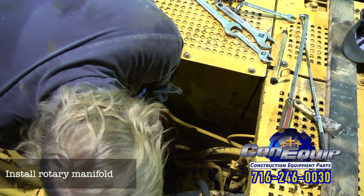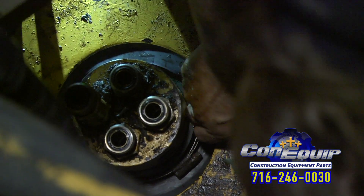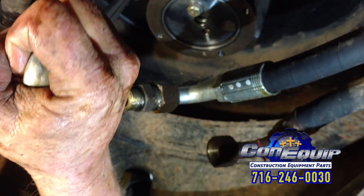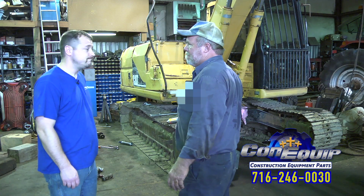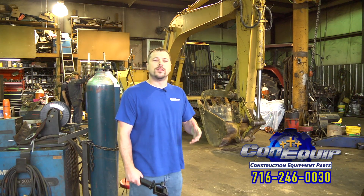We've got the top row bolts torqued and double checked. We're fixing to set the rotary manifold in. We've got a new rubber seal for the top of it — which is probably what let a lot of the water get down into the old bearing and mess it up. We're going to drop it in and start hooking up hydraulic hoses. It won't be much to finish up the job after that. I always get a little wet with hydraulic fluid, but it's all part of the job. Always check for leaks after everything's done — you've got a lot of hoses that had to get attached, some oil seals and everything, so always fire it up, run it for a few minutes, and check for leaks.